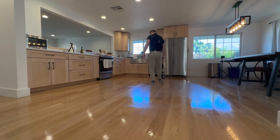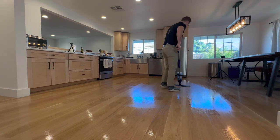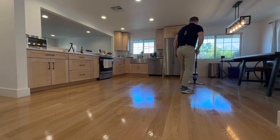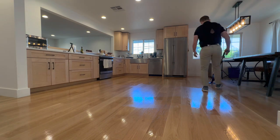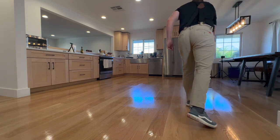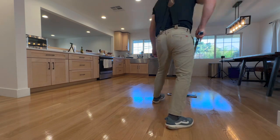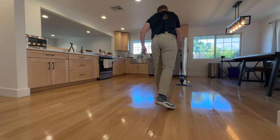...buff and coat done on your floor. And even if you're not planning to do that, the contaminants will go down into the cracks, and next time you have a refinish, you risk the finish turning white in the cracks, causing serious problems. So I really want to discourage you from using anything except for the Bona cleaner...